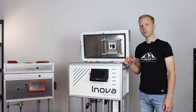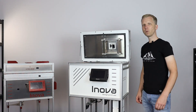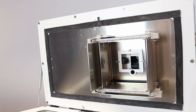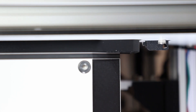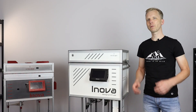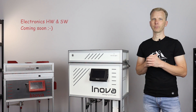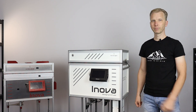Because I decided to open my plans to all of you after testing, I also had to start thinking about safety. For this reason I added two safety switches to the printer — one in the top frame and another protecting the overpowder bin from being removed — which will directly switch off the laser when you try to open the lid or pull out the overpowder bin. We have also made big changes on the electronics hardware and software side, but as these are quite large topics I decided to keep them for a separate video. If you haven't seen the video of how the first prototype performed in terms of printing, let's check it out. See you.